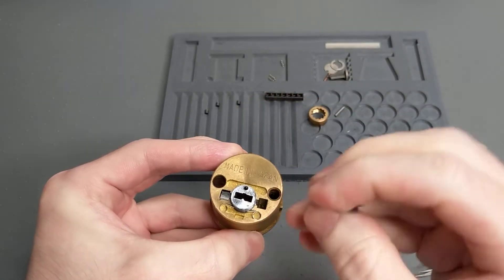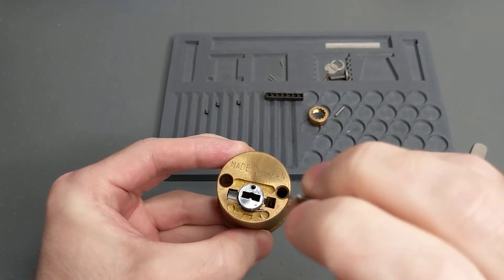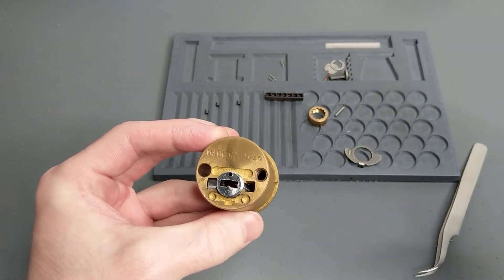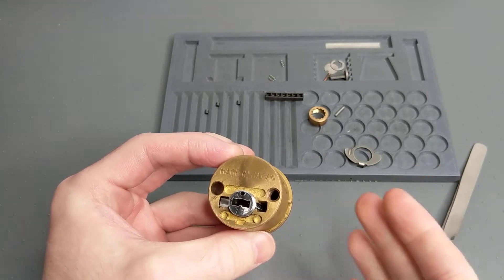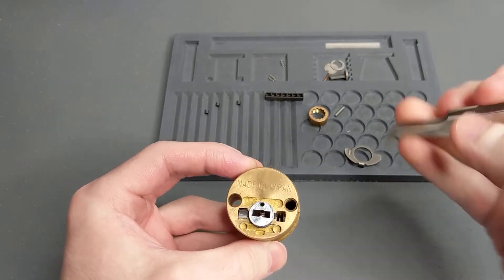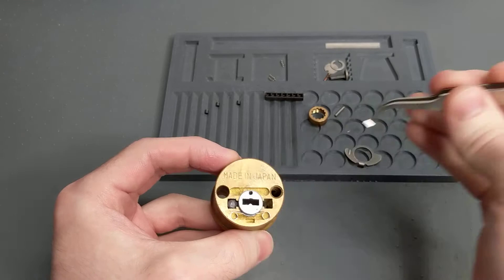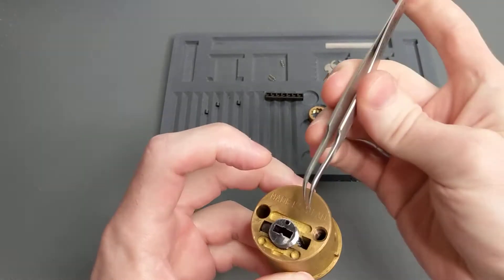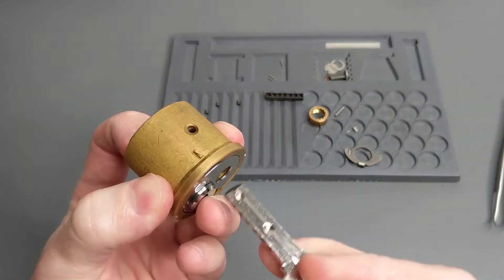This little pressed feature isn't quite deep enough. So now holding that in place, we are in fact locked up. Insert the key, and now we are again still locked up. So that's sort of a design flaw — it's relying on a pressed feature, just a little sheet metal part, to keep the Bible from shifting. When you put the key in it's repelling all of the magnets, and if it has anywhere to go it will. If it moves at all, it will no longer line up with the pin chambers, and then it will not re-lock itself.